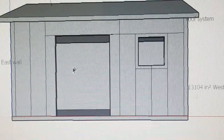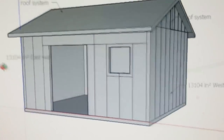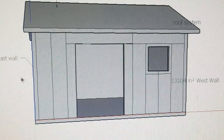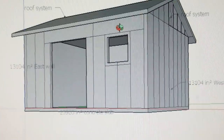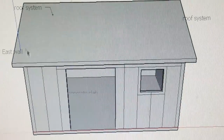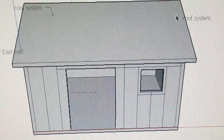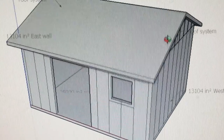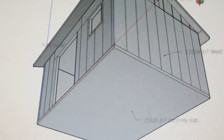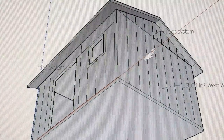Back at the shed drawing — I didn't account for the wall thickness over here. I needed 42 inches from the edge of the door, so I had to pull the door over as you saw earlier. I also divided the rooftop up by 16 inches to do 16-inch panels going that way on the roof. To make it all work out, I had to push the roof eaves in about three inches on each side, but there will still be plenty of roof eave overhang.